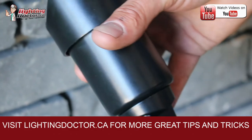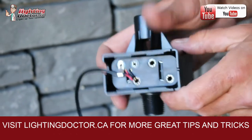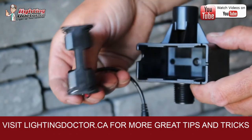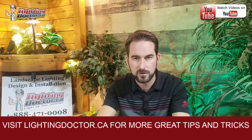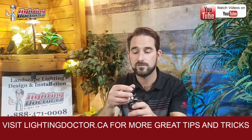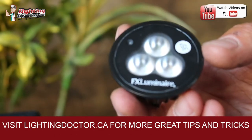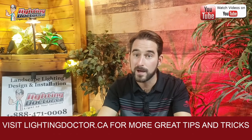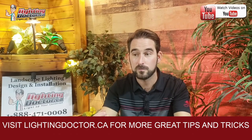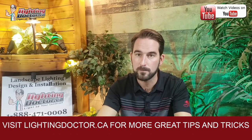That's why we offer our try-before-you-buy lights — you can actually buy this as a trial light, where it comes with a battery pack and you can just plug it in and go test it out. Weight and durability are really good. I like these ones as opposed to a lot of the integrative fixtures that are on there. An integrative fixture means it has a built-in LED board instead of a drop-in bulb. Especially if you're buying a cheaper fixture, you want to stay away from LED boards — most of those are crap and you can't just replace the bulb; you have to replace the whole fixture. There are some really good integrative fixtures on the market, but the price point goes up a lot.